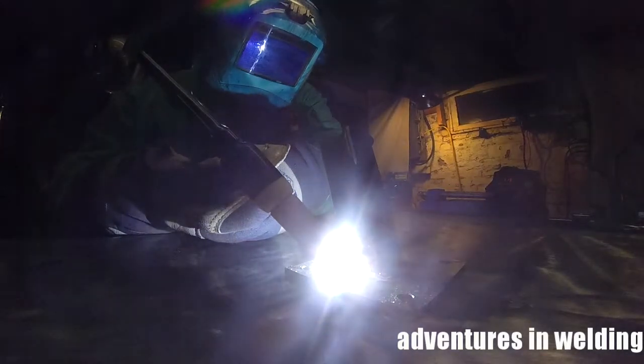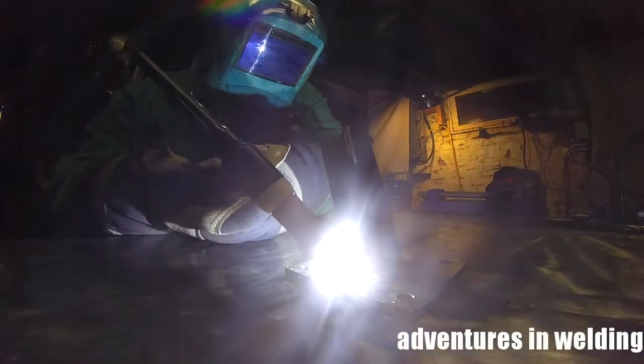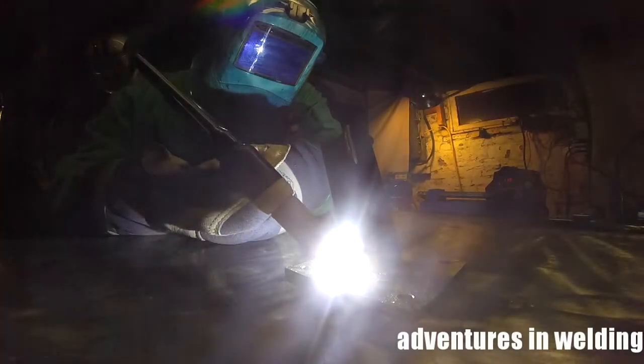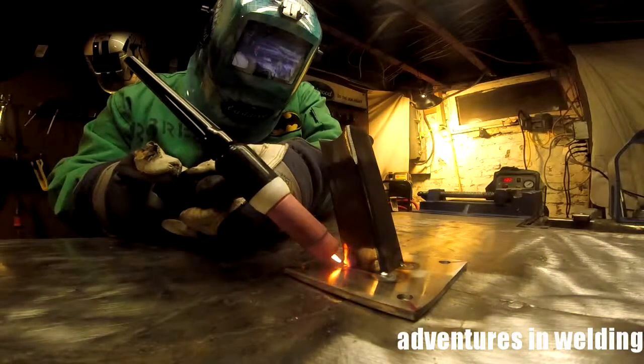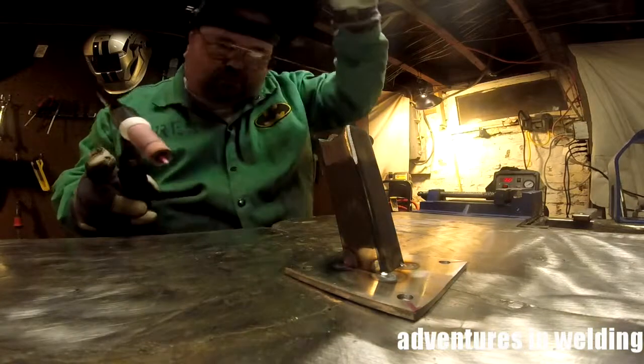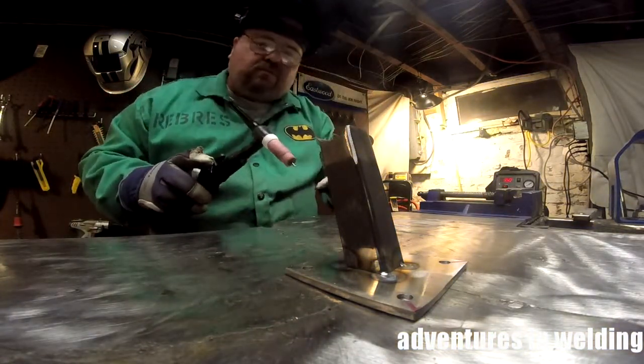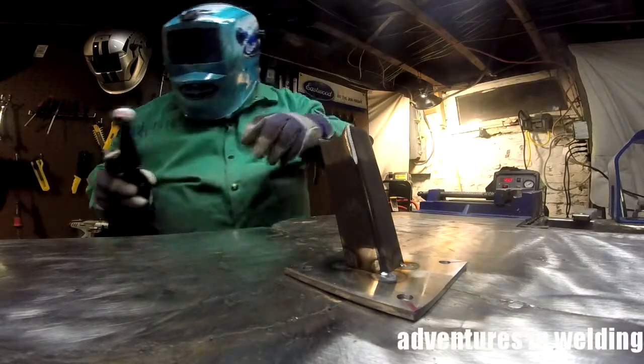Tried to do most of it with the speed tacking technique where you turn up to twice your welding amps and give it a blast of power. But my fit up wasn't hair tight, so it didn't work out. A couple places I needed to use the filler, little dip tacking. But it worked out okay.